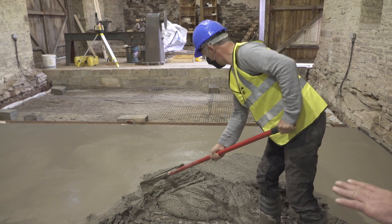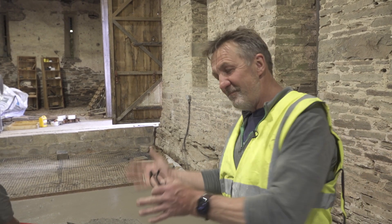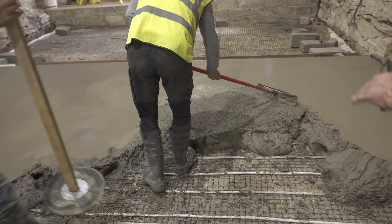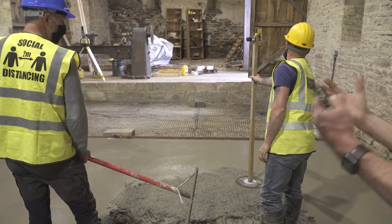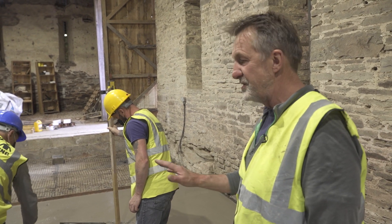What's really nice is you'd think this is about pouring it in a hole and floating it up, but actually everything requires a system. There are roles everybody's got to play: filling the barrel, making sure it's not too heavy, bringing it onto site, making sure protection is right, not splashing it, placing the barrel in the right place, gently raking out, making sure it's got that initial level, spot marking it. There's a great bit of telepathy and working together going on to produce a crisp and efficient system.